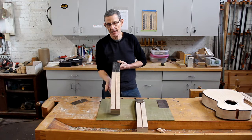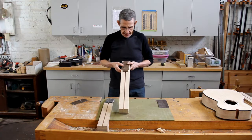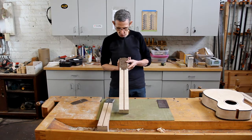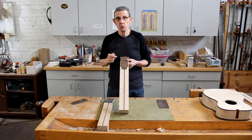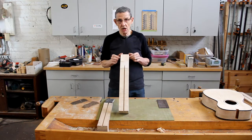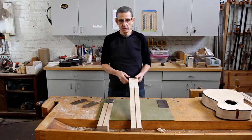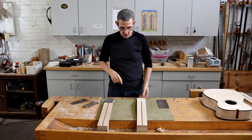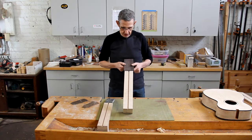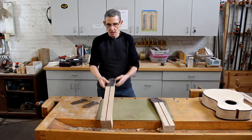All that we have left to do on this neck is to show you how to cut that taper on the back of the barrel, and then we'll cut the tenon. If your neck up at the peghead has a different design — in this case a peghead that's a lot wider than the three-inch stock — that's going to require that you install ears to accommodate the extra width. Once you install ears, you won't have a square neck anymore and it will be impossible to cut the tenon later. So on this type of neck with that wider peghead design, we'll install the peghead overlay and the veneer on the back at the very end after everything's done.